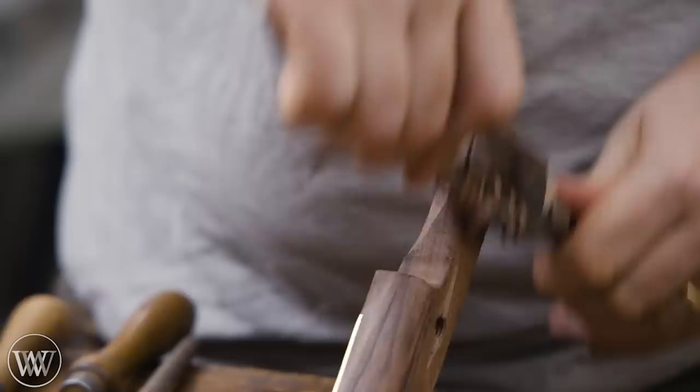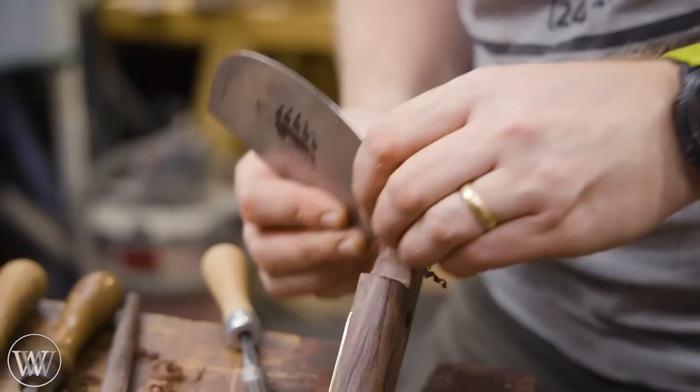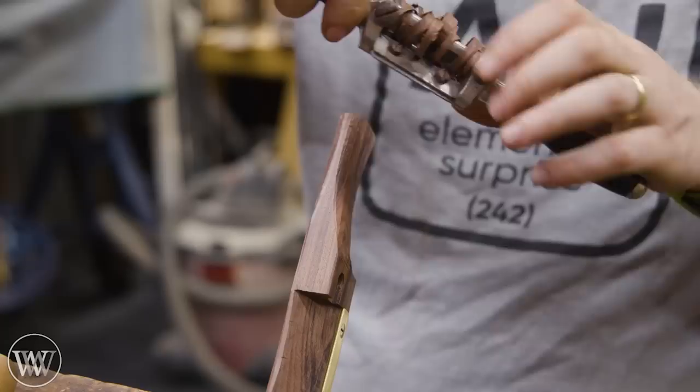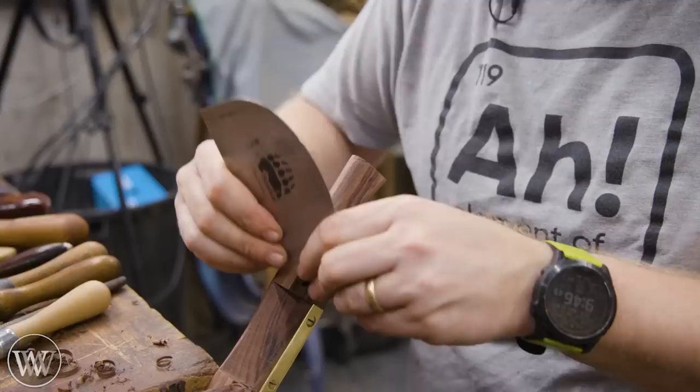For the handles, we don't want those to be blocky. We cut them to the rough square shape, but now we're going to plane them down to right where we want, round all the edges, and then hit them with a card scraper. The card scraper gives you an amazing surface. I love this one from Bearcat Woodworks — it's a chair-shaped card scraper, designed for chair legs and spindles. I love pulling it out for nice rounded shapes, and it just works every time. Especially on this rosewood, it scrapes beautifully — it is an incredibly nice wood to finish.